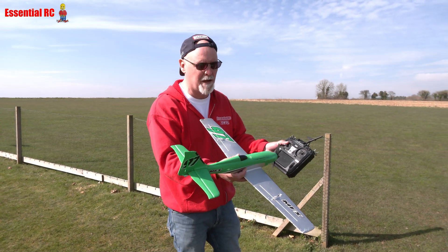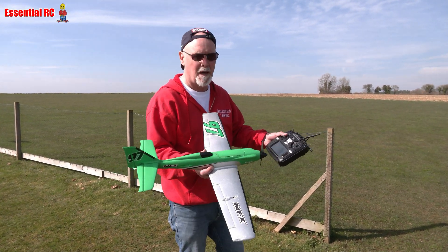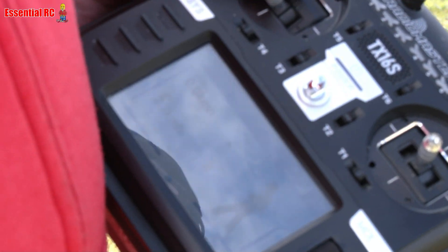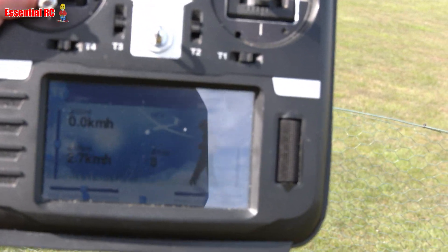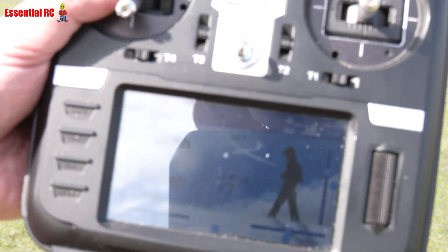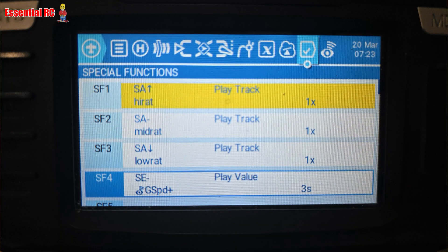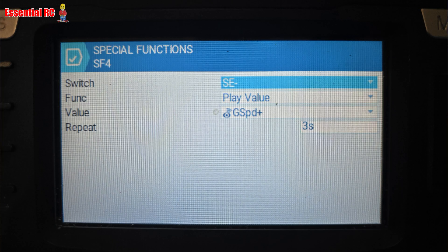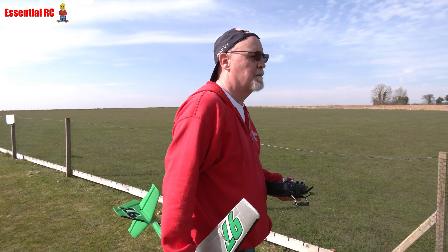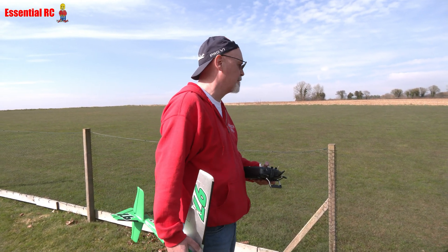To get these sensor values you need to go into the sensor tab and refresh to get the new available sensor values. You can see I've got eight satellites, ground speed, and maximum ground speed. I've set up a switch so every few seconds it calls out my maximum top speed. There's no wind at the moment so ground speed will be pretty much the same as airspeed, which is good - we'll get an accurate measure of how quick this is.